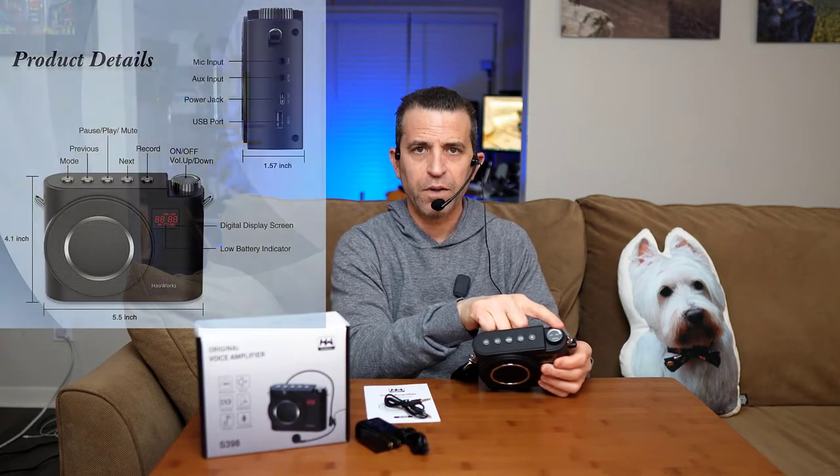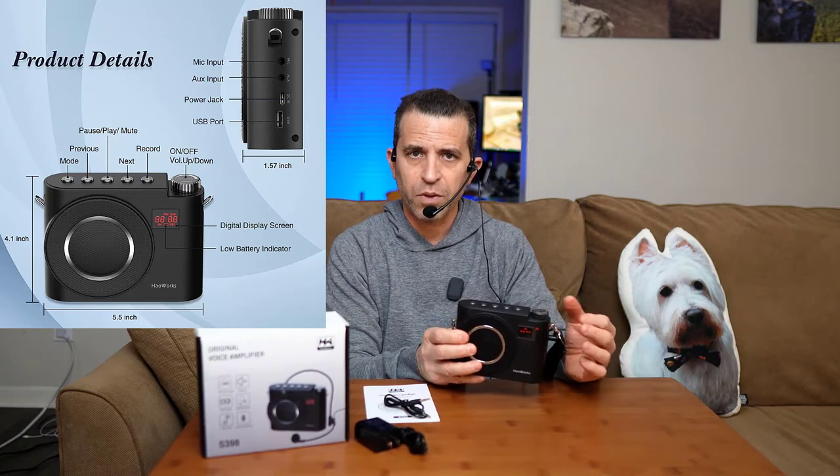As far as the functions, you do have your power and your volume. When you turn that on you adjust it and raise the volume. You have your mode button. You have your seek rewind, play/pause, seek forward, and then record. Those are the functions, and of course your speaker and your display. As you can see, it tells you the battery life and what mode you're in, and when you're recording it shows the time. Now I'm going to go ahead and raise the volume — and now you hear my voice. This is currently as loud as it will go. It may not sound like it's loud, but it is loud when it's directed towards somebody. Just be careful with the microphone, especially on the higher volume — you don't want to put it in front of the speaker or you're going to get that feedback.